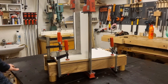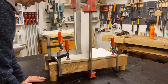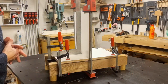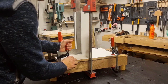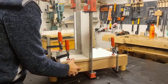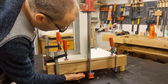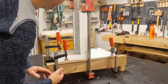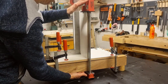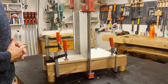There's no such thing as a typical glue-up in woodworking, but for a glue-up like this I start by moving the feet out of the way so they don't interfere with my clamp positions. Then I clamp my base material down to these clamping elevators so things don't move around. Then I apply glue, and this space is big enough to reach with my big parallel clamps — so I clamp around the clamping elevator and it acts as a big clamping caul for the glue-up.